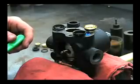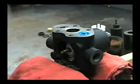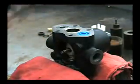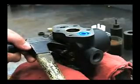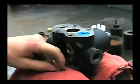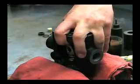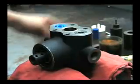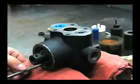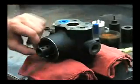Now we can remove the shaft and remove the sleeves. The grease fitting is a press fit into the cam bearing, so to remove that, take your claw hammer and just pull that straight out. You'll probably want to replace that when we reassemble it. And then on the other side is this retaining ring. You want to get behind this with a screwdriver, being careful not to damage this bearing, and you can twist that right out.